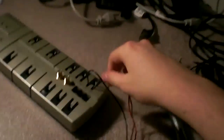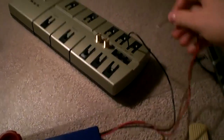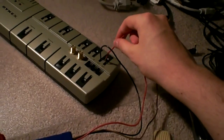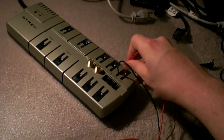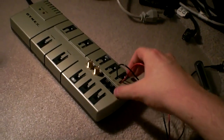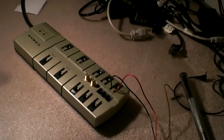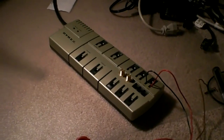Here we'll try the red wire. Now, many controllers work by sending actually two signals — turning the switch on quickly, then off, then on again for the remainder of the elevator's time at a particular floor. However, some are miswired, and if you've ever heard it go 'ding-ding,' that's because it's sending two signals through the down wire even though it only needs to send one. It's an error on the part of the wiring. So here's the down signal.